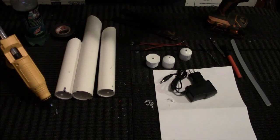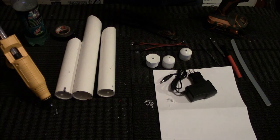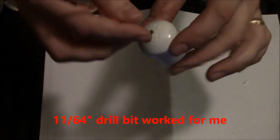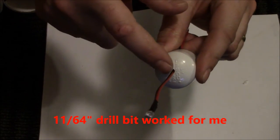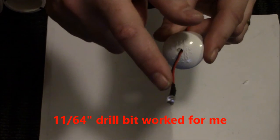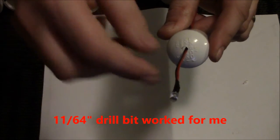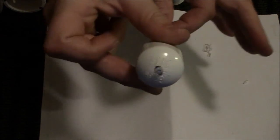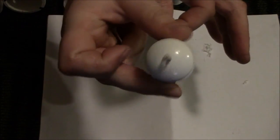Okay, so take your LED, take your piece of pipe. And what I did was I actually cut this hole to match this black area where the shrink tubing is, where the resistor is. I matched up the drill to that. I'll put that in the description. Take that down and see, nice, snug little fit. Woo. So now you have that inside the tube like that.